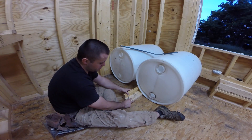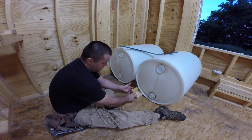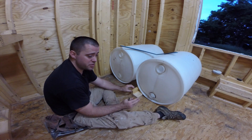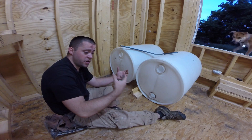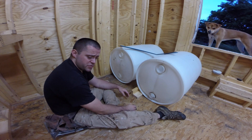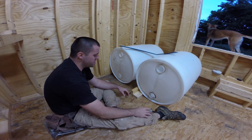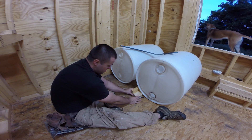What I'm going to do is put two 2x4s the length of the trailer, just like this, so that it carries the weight toward those outside beams. It's not going to carry all the weight — there's obviously going to be some sag — but the floor also has 2x6s running this way with the proper hangers. This is three-quarter-inch plywood, and I believe every square inch is supposed to hold a lot of weight. So just to keep them solid and in place, I want to put these extra 2x4s in here.